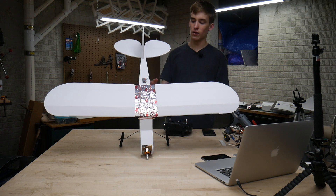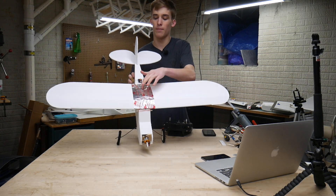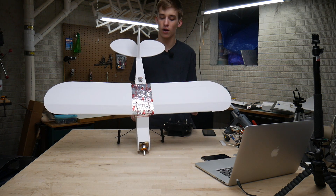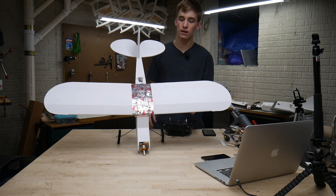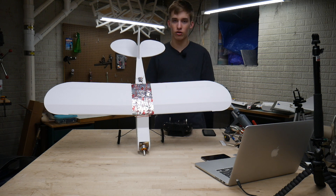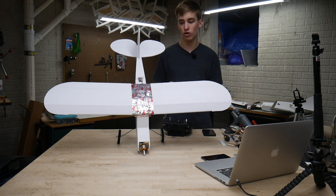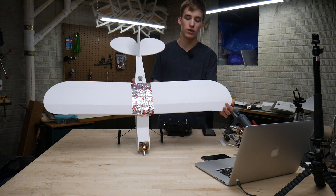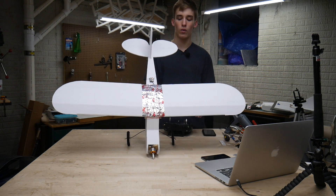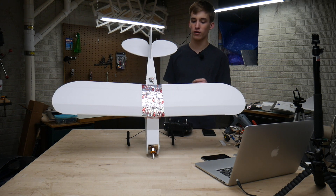In terms of durability, I've added aluminum tape on top of the wing system right here, and that's going to help with the rubber bands that are holding the wing on. Usually the rubber bands will dig into the foam, and that's just not good because it takes away from the structure of your wings. I definitely recommend this especially from a beginner standpoint — this is where a lot of your blows are going to happen when you hit the ground. Make sure your landing gear is installed too, as that's really essential for your first flight so you don't have to hand launch and then work your way back to your controls.